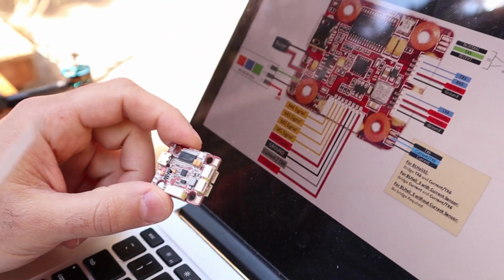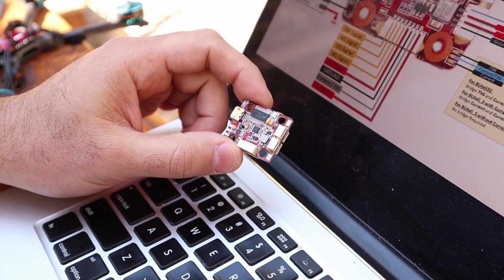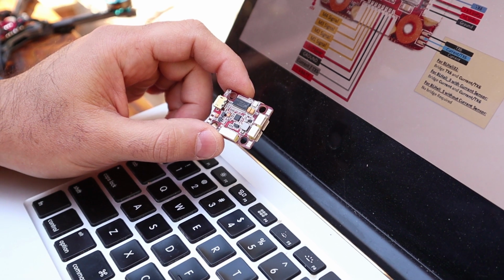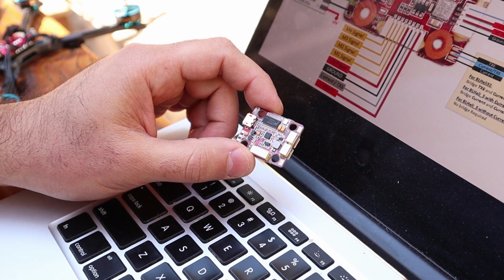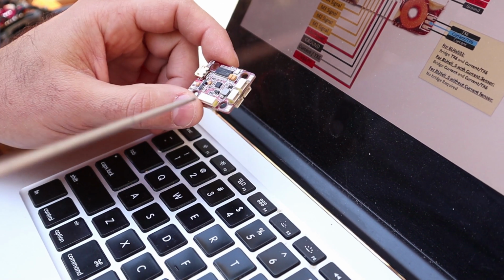Just know that you sometimes have to change the wiring in your harness to what you are wiring for. So be careful to double check that, triple check that, because oftentimes even with a smoke stopper, if you screw that up, because it's after a regulator, you can still smoke something. So be careful. Finally, a couple more points.